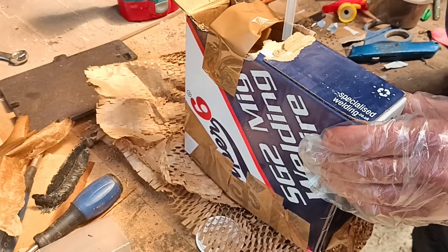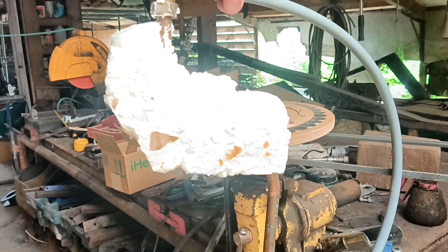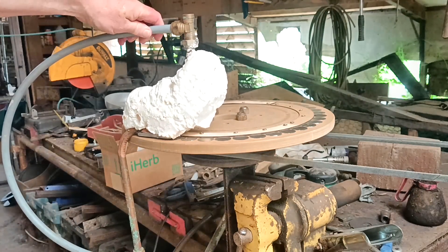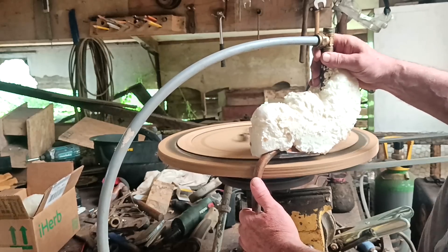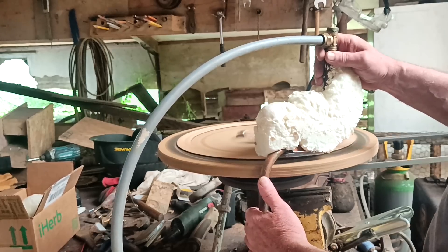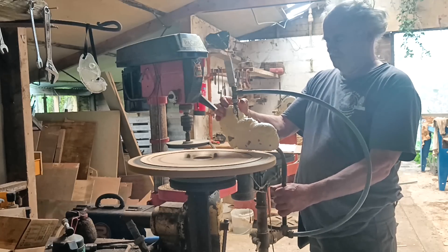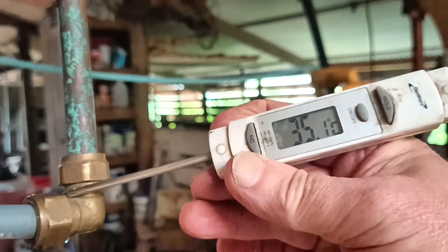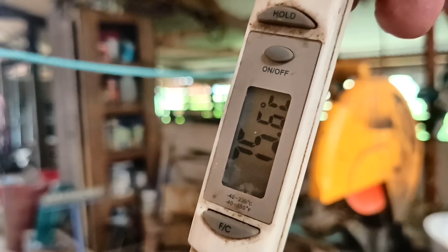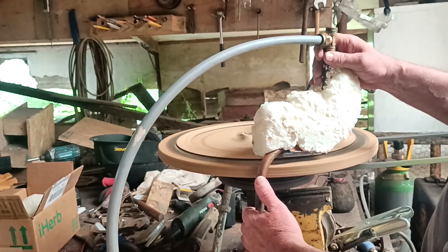So I insulated the plate using some expanding foam. Now, obviously, if this setup was ever run without water then the temperature would rise too far and the solder would melt and the whole lot would fall apart. But this is just an experiment — as long as there's water in there, it won't get past boiling point. Unless, of course, it was in an airtight circuit, in which case it would turn to pressurized steam. But let's not go there either, at least for now. The insulation helped a lot, because the water at the bottom of the pipe reached 35 degrees Celsius whilst the top was still at 70 degrees. And this proved that circulation was happening and, theoretically, one could heat a large tank of water using this exact method, though it would take a while.